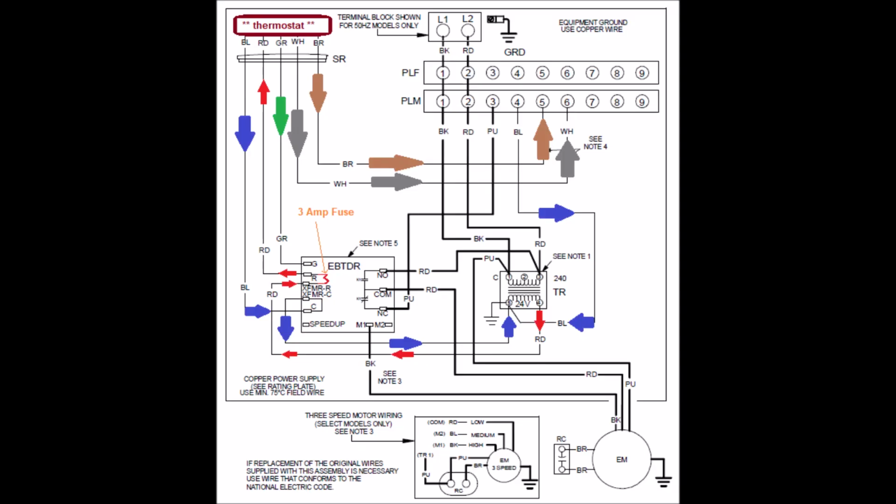Brown, just like white in this case, except that you have to have a big enough electric heat kit. In our case, we would need 2 heat relays in it. And since I don't have two white wires here, they go brown for the second stage. So that brown is going to come up, go to wire number 5 of the male plug. And on a larger heat kit, wire number 5 on the female plug would go to a second heat relay coil. And blue would be the common for it as well, because they would be junctioned together and have that return side back. That's pretty much the high and the low voltage. Hopefully it makes a little bit of sense. If you have any questions, ask me.